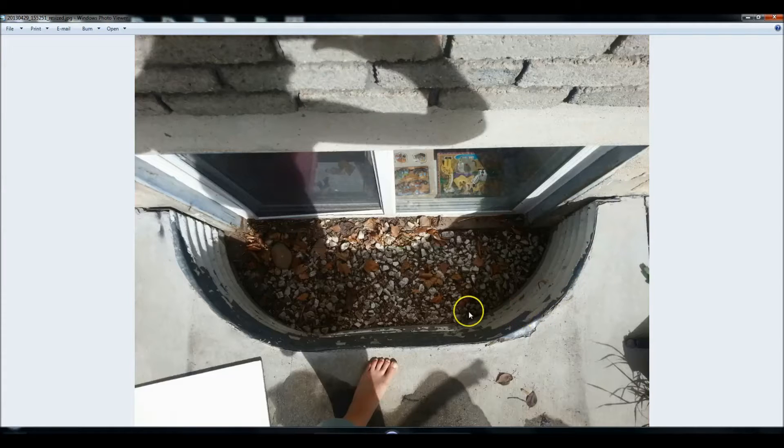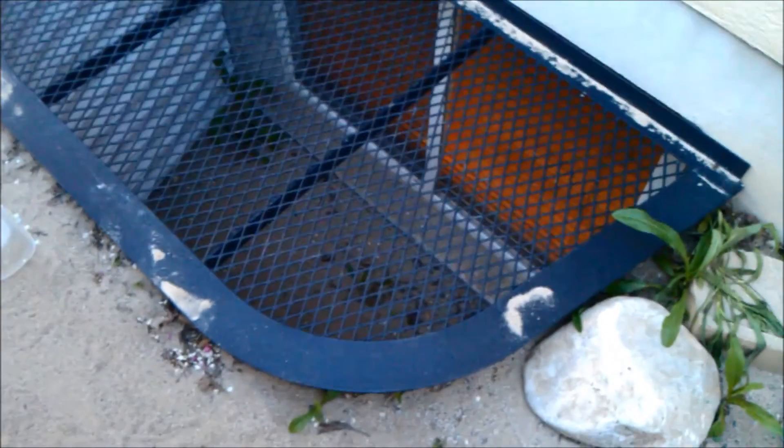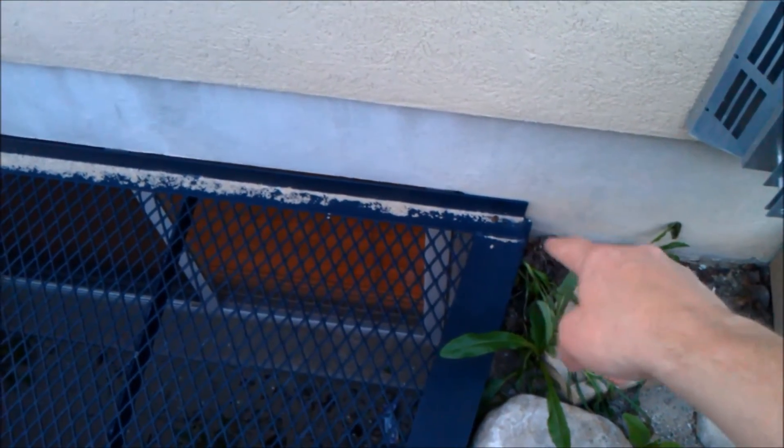This window is kind of crooked as far as I can tell, so what I'm going to do is create a template for her to test out before I actually go and weld anything up. The type of window well cover I want to make is like this one here - there's about a three-and-a-half to four-inch wide flat bar on the very back, a piece of angle iron that goes all the way across, and a couple of supports running lengthwise.